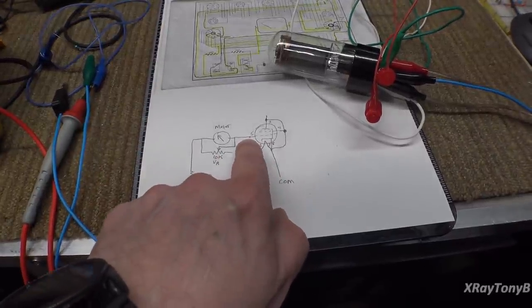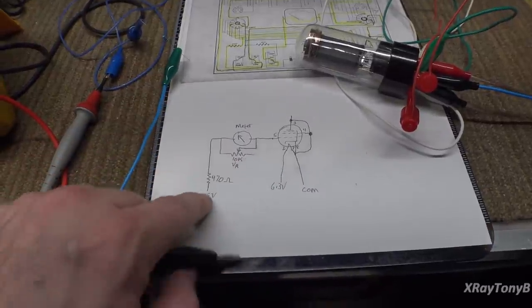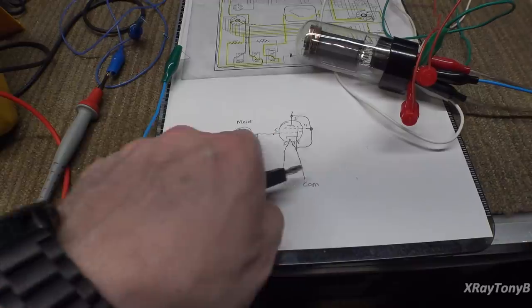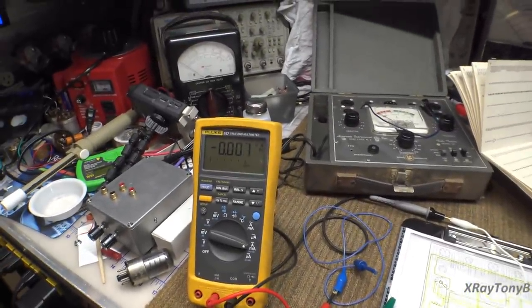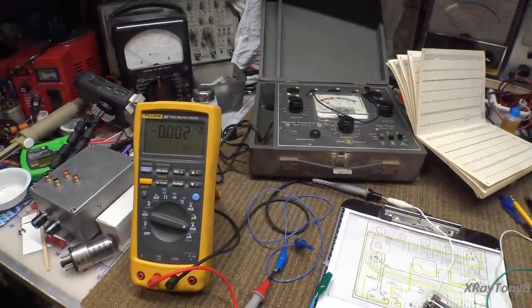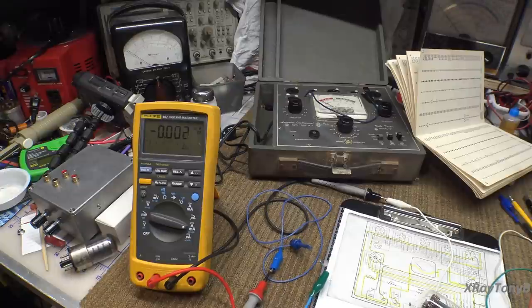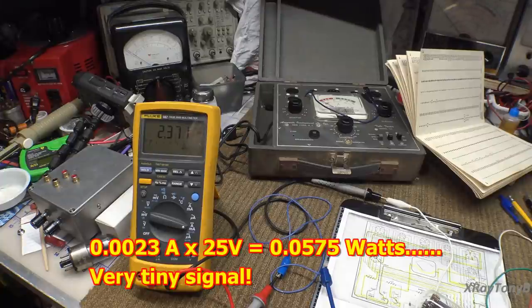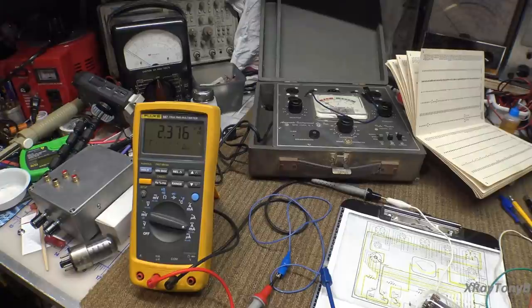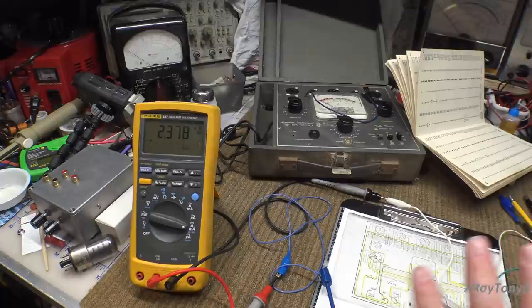This is going into pin 5. This is not exactly what we have — I have a 10k right here, and then an actual shunted meter, which is the Fluke, with very low resistance. If I put that 25 volts between the control grid and the common, you can see you get roughly 2.3 milliamps. So the tube is showing emissions. That's really all that's happening when we use our little emissions meter. This is just a very simple demonstration — it's not exact, it's not perfect.